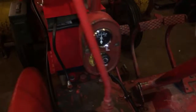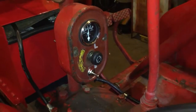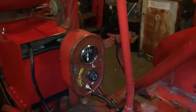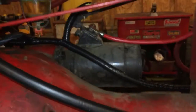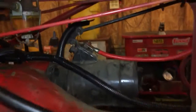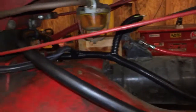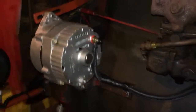There's my dash — I haven't made any connections inside the dash yet; they're all just stubbed up in there, coiled up. We just got all the connections done tonight and everything hooked up in wire loom. That little wire there will just bend right down and hook right onto the starter, and that'll be my hot wire for the alternator to the battery and into the amp meter.